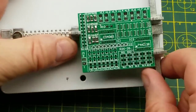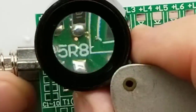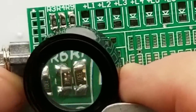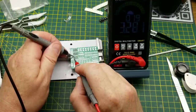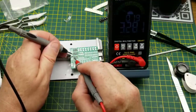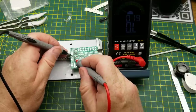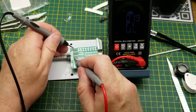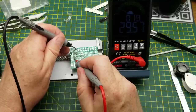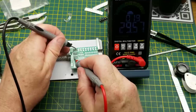All right, that's the first nine resistors put on, and yes it's ugly. But as ugly as they are, I think they're all electrically valid connections. Each of these resistors looks like it's about 3.2k or 3.3k, and going all the way through the whole chain - 29.5k. So I think I've got them all together.